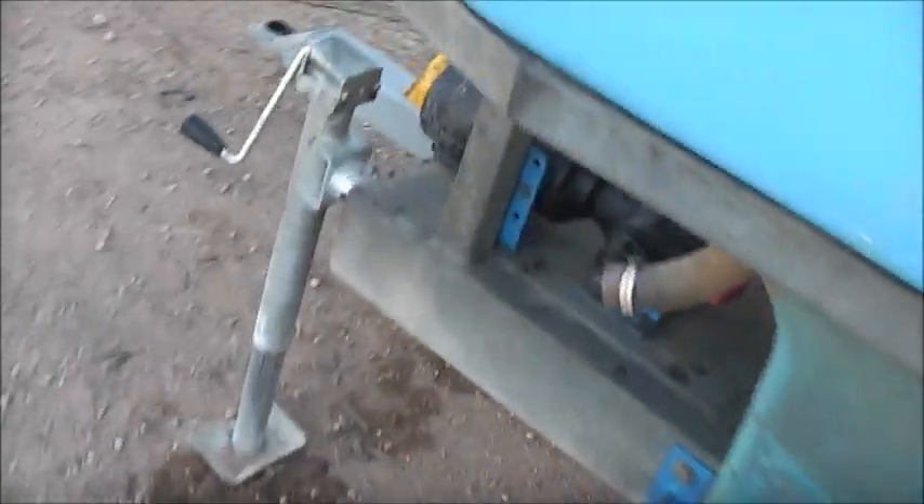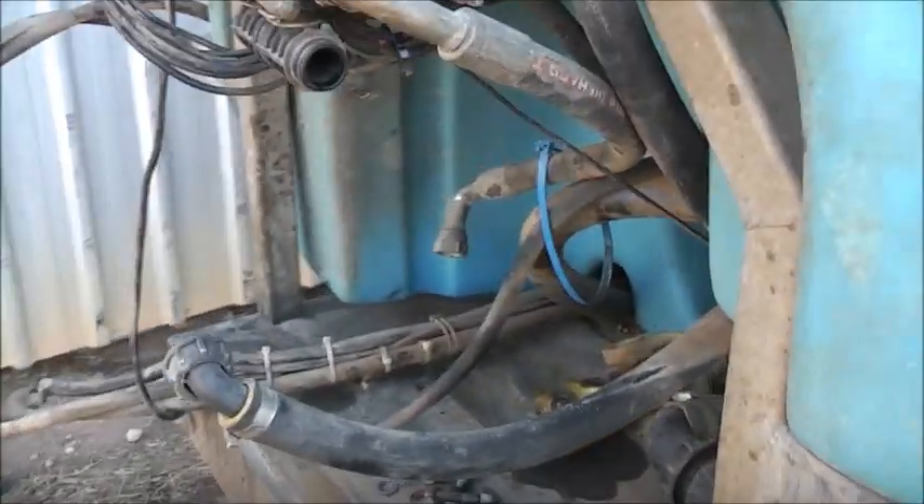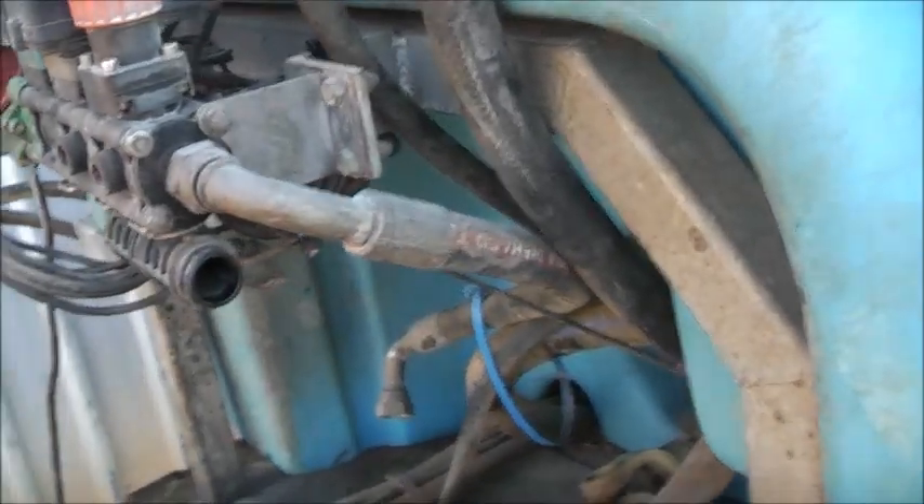That is actually for rinsing the pump out. It has many features, these big vats. You're supposed to tap a hose under there. When it taps in somewhere on a suction, you can flush the pump out instead of going back to the depot and filling and flushing your tank out that way, because that just takes a little time.